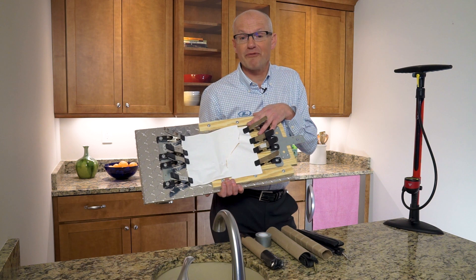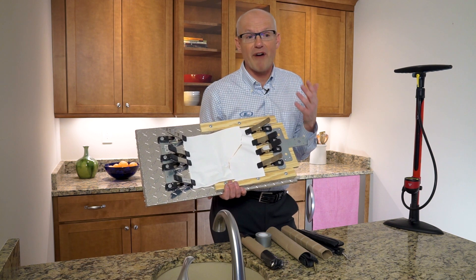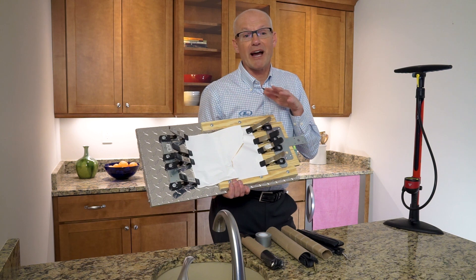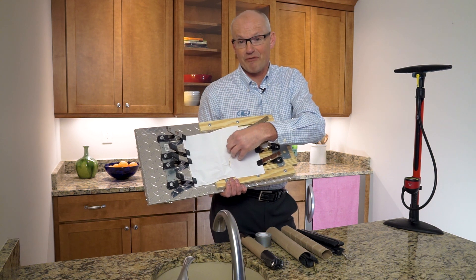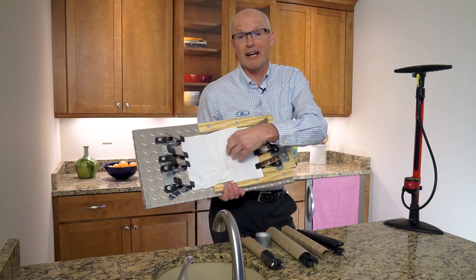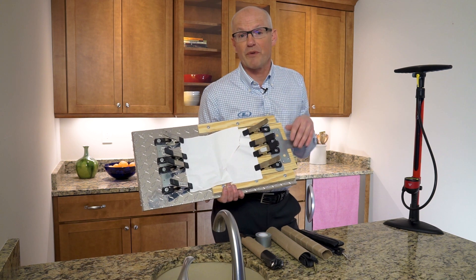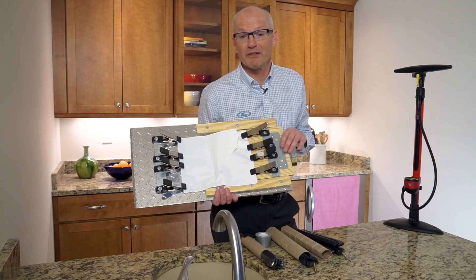Now we can take this one step further to show you what happens in a horizontal well. When we're fracking rock in a horizontal well, we cannot apply an external force on the outer edges of the earth and pull it apart hoping it fracks somewhere. Instead, when we hydraulically frack rock we apply a pulling force from within the fracture — within the flaw made in the rock beforehand — by applying hydraulic pressure inside the fracture. So instead of applying force from the outside, we apply an inside force using water pressure, and we pressurize this hydraulic fracturing fluid with pump trucks.